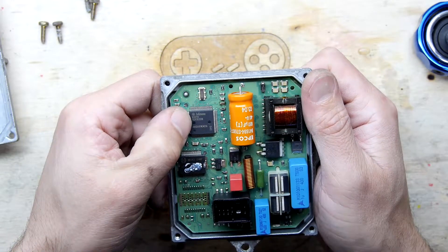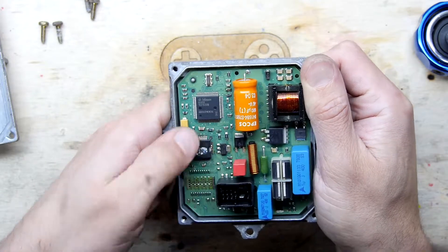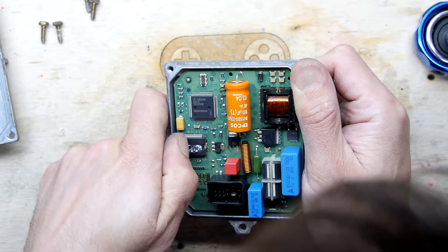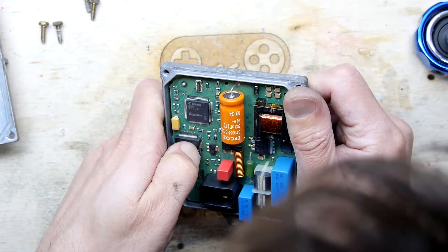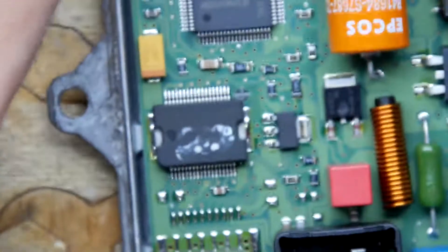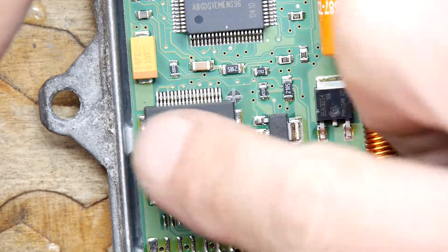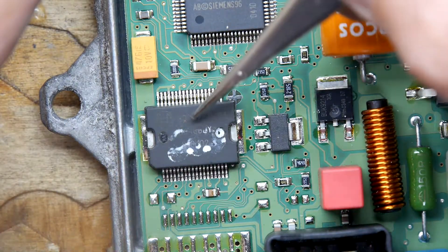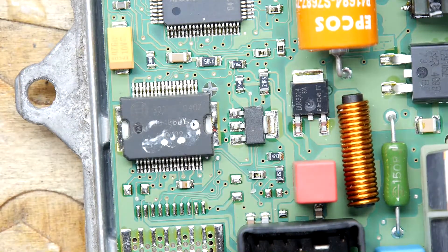Nothing going on, but it's almost unfortunate that it looks in such good nick. If I was going to replace anything, I guess it would be this 680 microfarad, 40-volt capacitor, and possibly check out this coil. But I think I'm not going to do anything with it — it's fine. Let me get some part numbers off that at least. This is an Infineon B59703, Siemens 96. This other chip is a 30343. Then on the main chip: B438 — B-E-Y. So that's what that is — that's all she wrote.